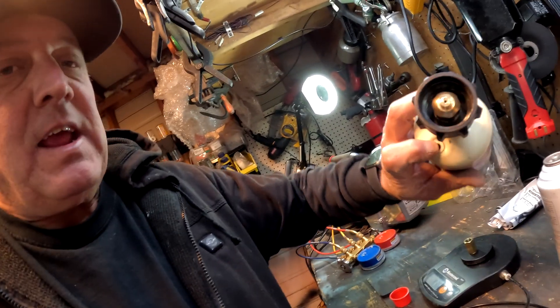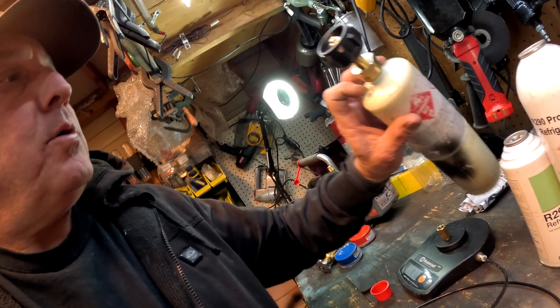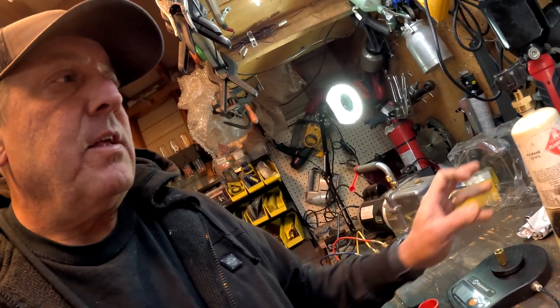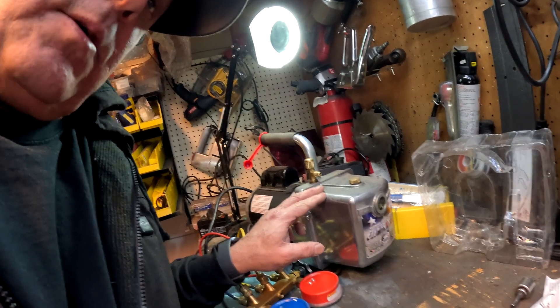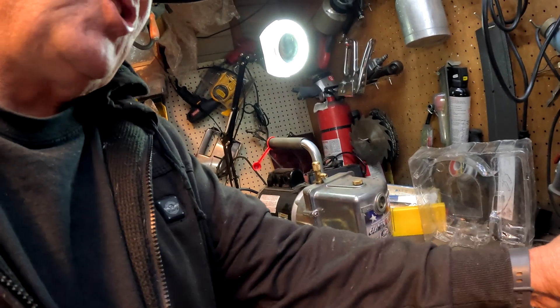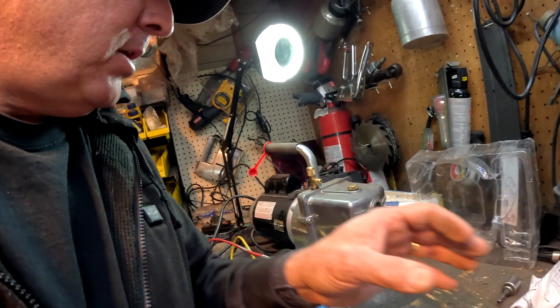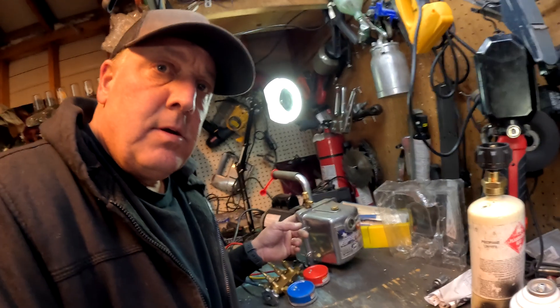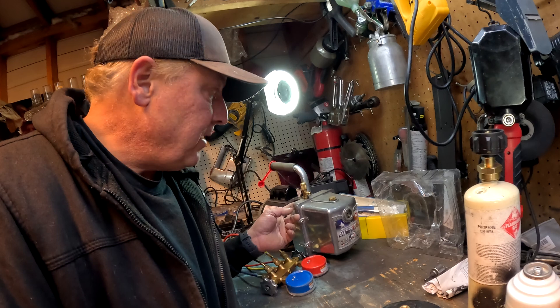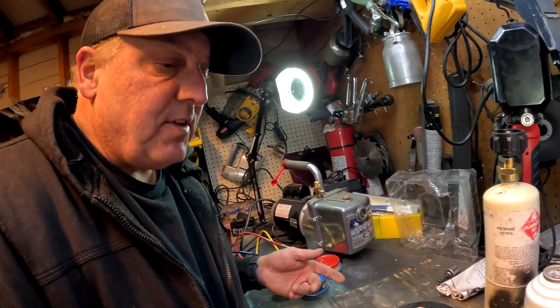What I do is: there are little pins inside of here you can take out, and then you can let the bottle air out for a while. After that you can grab your vacuum pump, but you have to make sure there's nothing left in the bottle because your vacuum pump will combust. You shouldn't use the vacuum pump unless you know there's nothing left in there — I like to purge them with nitrogen first.